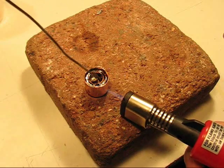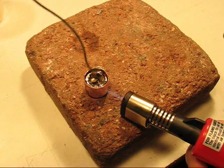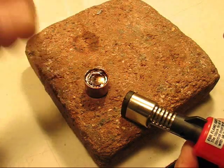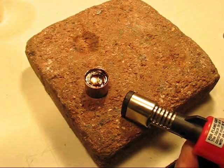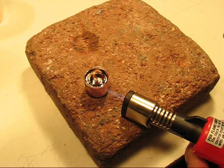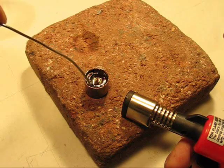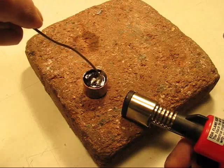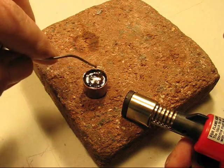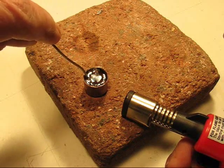You don't have to have constant heat. Once you get it heated up, it'll stay heated pretty good, and then you can just start running that solder in, filling that thing up. You can see it's plenty hot enough — you can see all of the rosin coming to the surface. That's one of the nice things: the rosin lifts up to the surface so that you have solid copper underneath. And that's probably plenty, because like I said, I need to cut this off anyway.